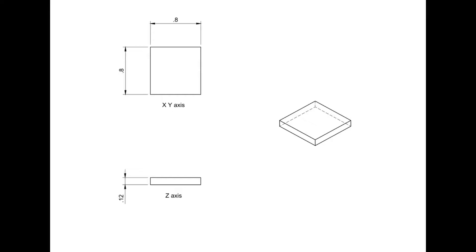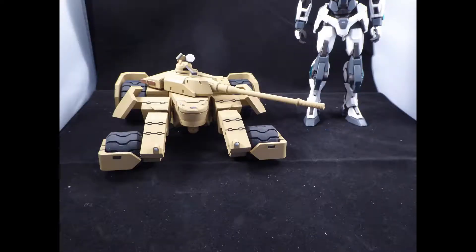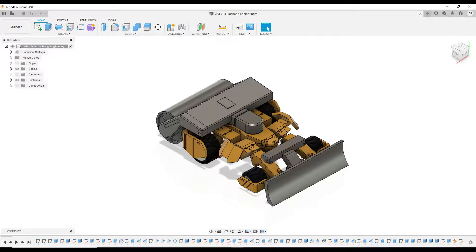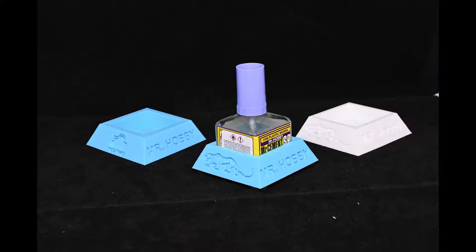For detail, the smallest you can make a part is 0.8mm in the XY and 0.12mm in the Z. I would advise against making something this small as it's likely to break coming off the build plate. All FDM parts will have layer lines — you will need to fill and sand to clean these up. For scale modelling, this means you can make large models relatively cheaply. With a bit of sanding you will be amazed at what you can make. The Ambutank on screen is a conversion made on an FDM printer — parts were sanded down and glued onto a Dragon kit. The big appeal of 3D printing for scale modelling is not just downloading parts you find online, but making your own models, and as a training tool FDM is a good start. Being cheap to run means mistakes are a learning experience that in a few hours can produce a replacement part. Tools are commonly made with PLA as it's less brittle than resin and tough enough in most applications.